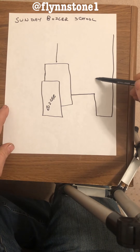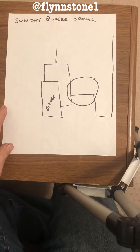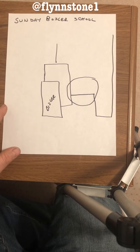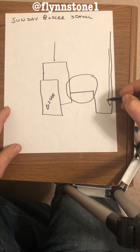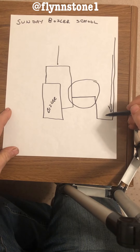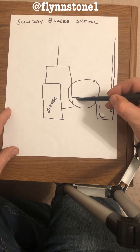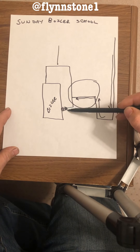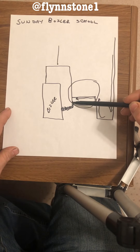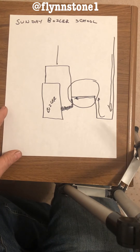This point right here is causing massive water hammer in the system. As your cool condensate water is dropping down and filling up here, it has this far to travel back into the boiler. Your steam, which is born in the bottom of the boiler, is filling up and meeting this cold condensate water, causing that water hammer.